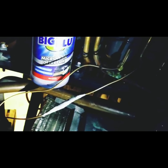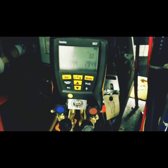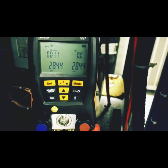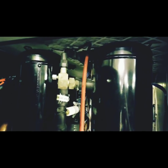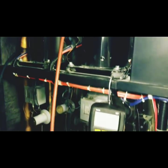We've been under a pressure test for a little while now and I've soaked all of this — we have absolutely no bubbles. We're 11 minutes into the pressure test, we have not budged, no soap bubbles. I'm pretty confident we're good to go. We're going to hook up the true blue hoses and the 2 CFM NAVAC battery-operated pump and see how fast we can pull a vacuum on this.